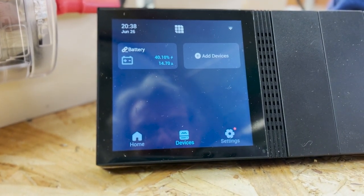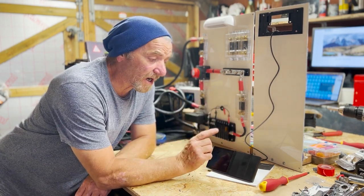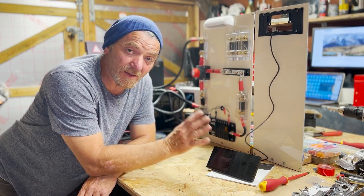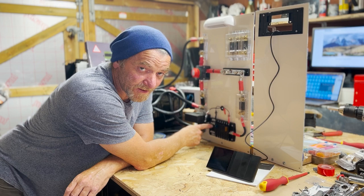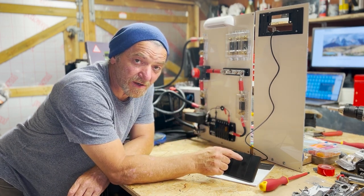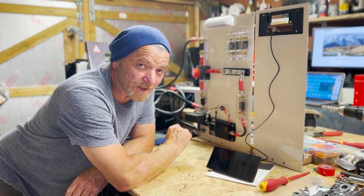My Renogy One unit is now working. Before I take all the switches apart and secure it to the bulkhead, I'm going to wire in a light to illuminate my electrical cabinet, controlled by a switch on the outside. I'll run an earth cable from the earth bus bars up to the light, then run a power line from a fused bus bar to the input of the switch, and from the output of the switch to the light itself. That way I'll be able to switch the cabinet light on and off.